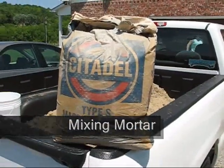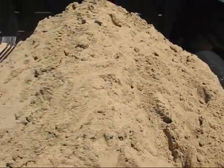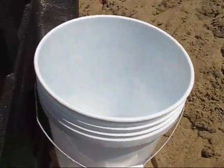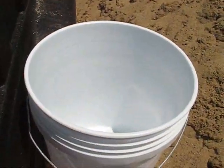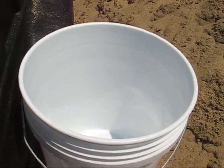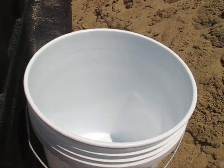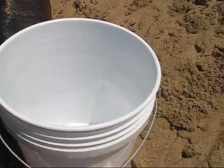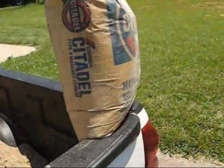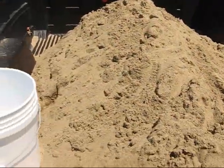Let's mix the mud. That's masonry cement and masonry sand. The bucket mixture is three to one — three sands to one cement. Use a bucket; this is the proper way to do it. Don't use a shovel — a lot of people do, but you can't be accurate when material is slipping and falling off the edge. Use a fixed volume: a five-gallon bucket, two-and-a-half gallon pail, three-gallon pail — whatever you use, use a fixed volume instead of a shovel.